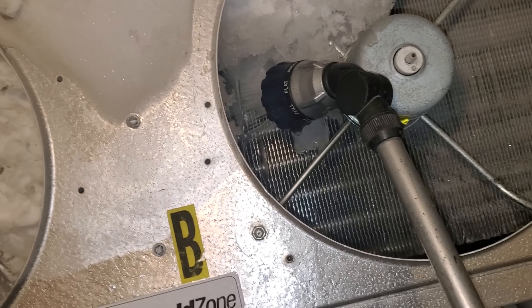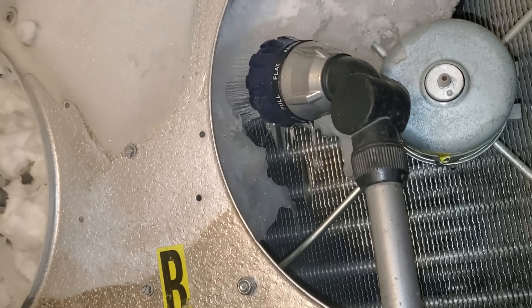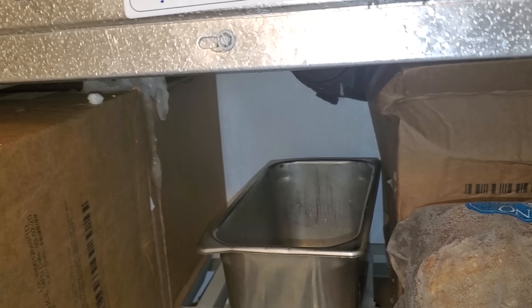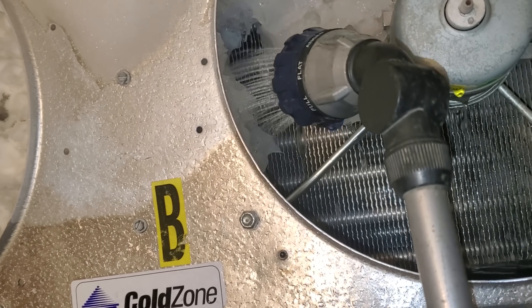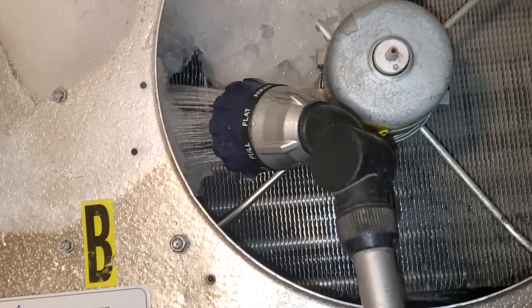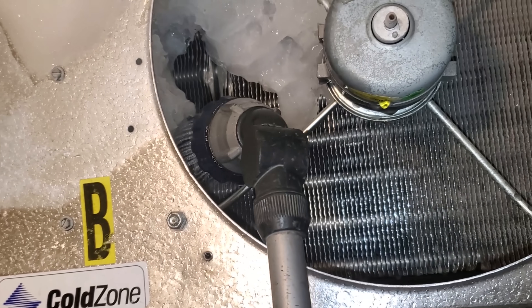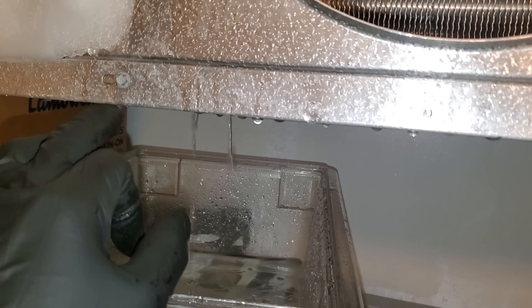That's where this wand really comes into play. It's got all the different settings on it, and I really like it because you can just go nice and slow. I've got a pan down here catching a residual drip. Normally I work from the top down, but because I don't want to saturate the motor, I'm working from the bottom up, which is a little counterintuitive, but it'll still get the job done. I'm lucky that the customer has hot water. It's taken me quite a while just to get to this point because the drain pan's partially frozen over here too, so we've just got pans down there to catch everything.